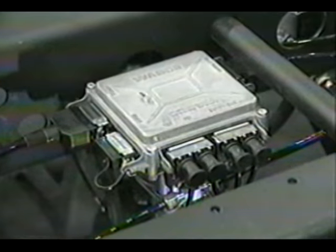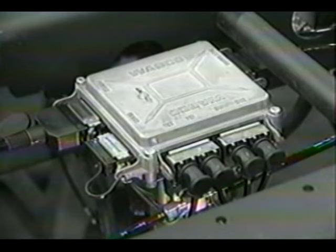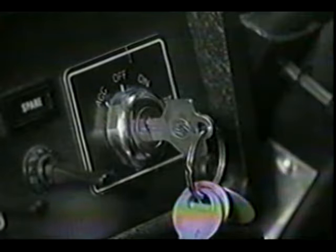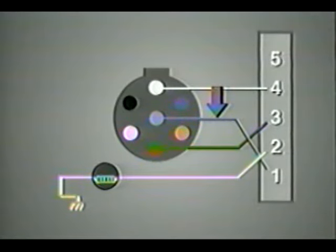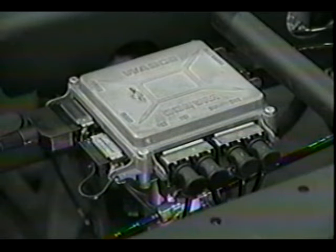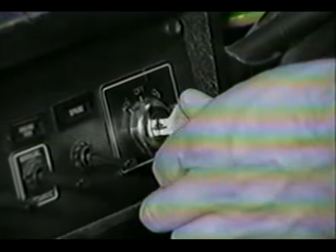For the 2100 basic ECU, or for any ECU without a diagnostic tool, the procedure for reading expert mode codes is as follows. Turn the ignition switch off or disconnect power at the blue wire of the 7-way connector. Apply power to the stoplight circuit by depressing and holding the brake pedal, or by applying power to the red wire of the 7-way connector. Give the ECU time to complete its self-tests. While continuing to apply power to the stoplight circuit, turn the ignition switch power on and off twice, then back on.